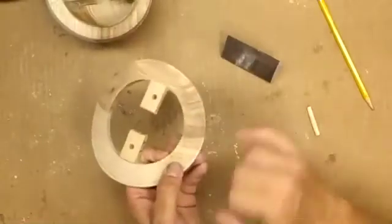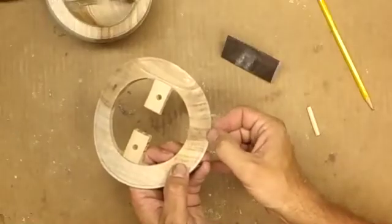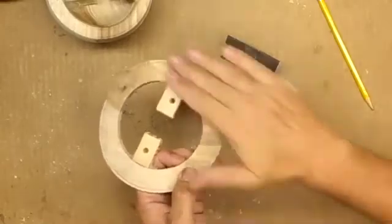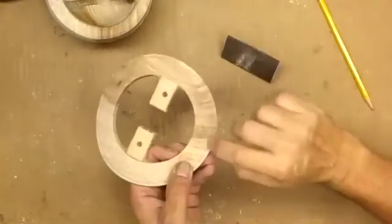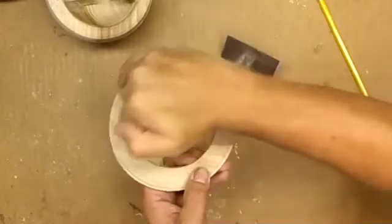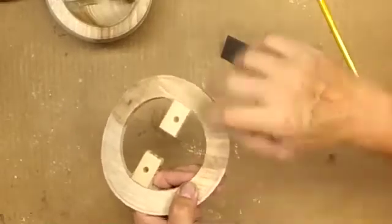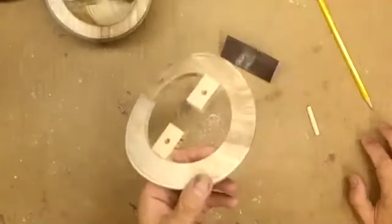If you want to dye it, that line's really valuable. So you put the dye on, let the dye bleed just across the line, but not too far in where you're destroying the glue joint. And then you sand off the surface because you'll have raised the grain, and the stain and the pencil line will come off with that. And then the staining of the dye will tell you how far to dye the next layer. So you'll do a second coat of dye that will come up. So it's a slow, kind of tedious process. You want to treat that with care.